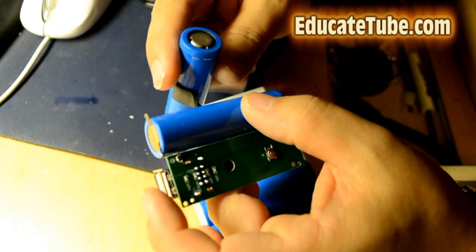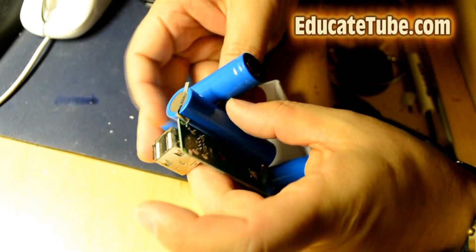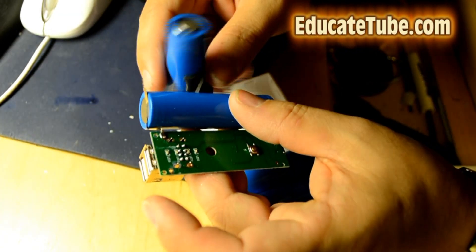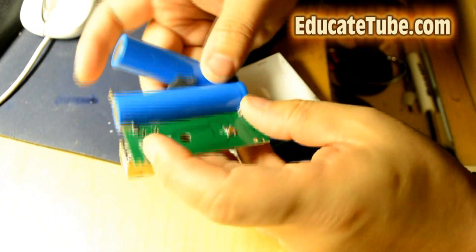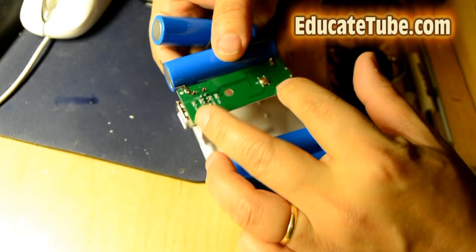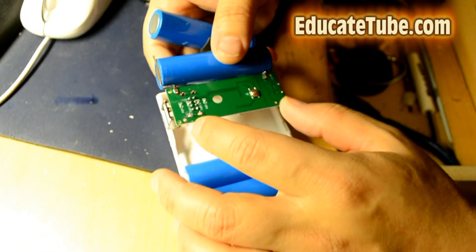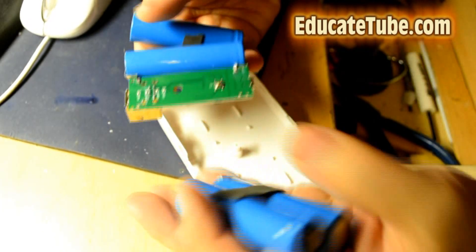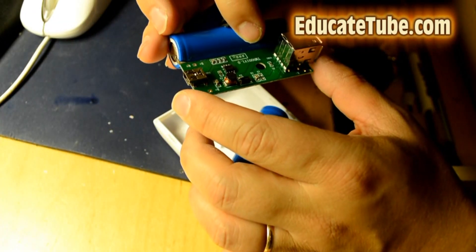It's not even properly aligned. If the batteries are in parallel, they should be oriented like this — not facing this way. Wired incorrectly, you'd get 7.4 volts instead of 3.7 volts. You have to line them up so positives connect to one side and negatives to the other. They didn't bother to make the effort to continue hooking up these batteries correctly. Very, very bad.